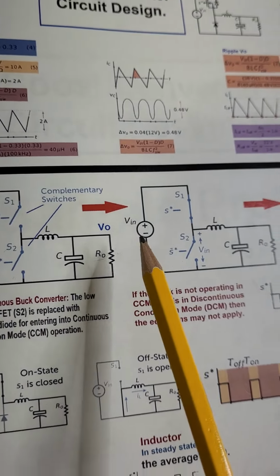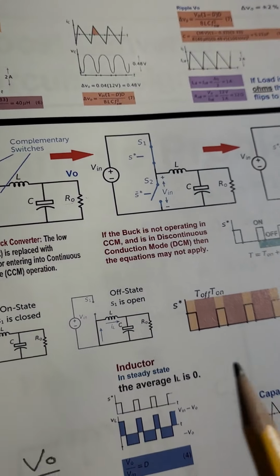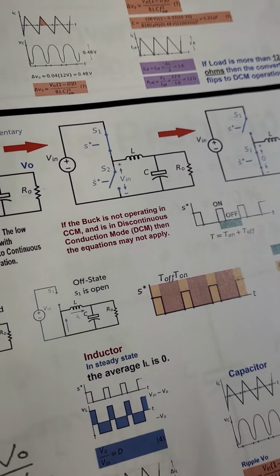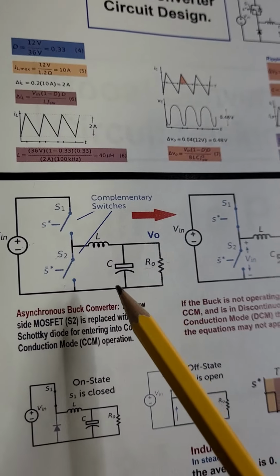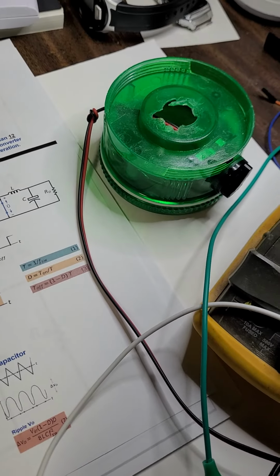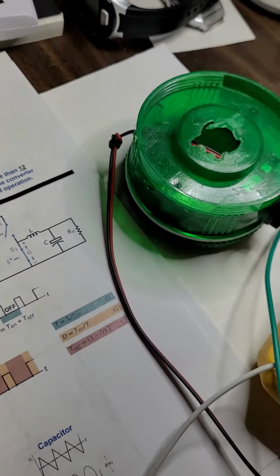Why don't we use the other kind of voltage regulators, the linear ones, like the LM7805, 5 volts, 9 volts, 3.3? The reason we don't use the linear is that linear regulators consume a lot of energy, and for battery operated devices that is very heavy on current consumption, converting the energy within the battery into heat and draining the battery very fast.